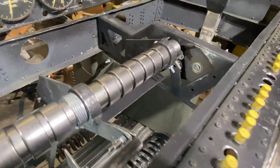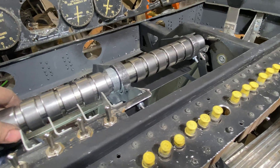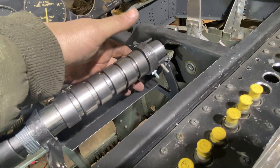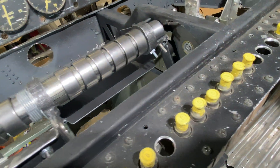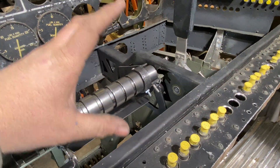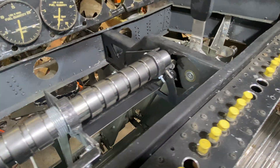What this does is establish — with these bearings that came in, there are 12 of them at about ten bucks apiece, so $120 just for those — with these on here and the proper measurements from the real aircraft, I now know that the sheaves for the throttles are going to be four and seven-eighths of an inch in diameter. I have a lot of pictures and dimensions of these; I thought they were five inches, but based on what I've done here they're four and seven-eighths in diameter.